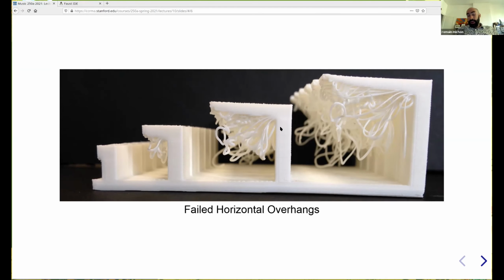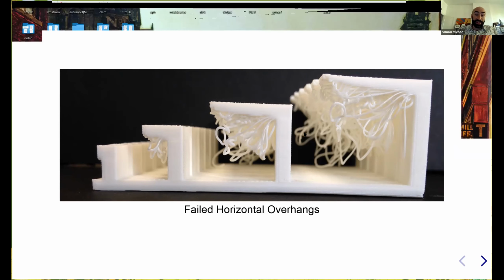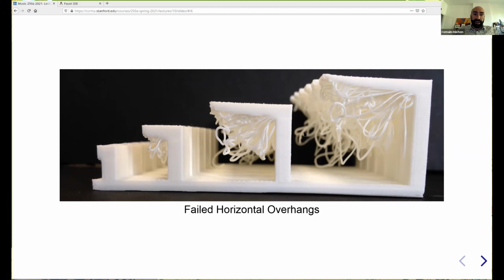You can also 3D print support material with the same material as the one that you're printing the object with. In some cases it works, but in many cases it's kind of annoying because you're going to have to break the support material, and its shape is optimized to be easily breakable, and it's the slicer which is going to take care of that for you. You don't have to worry about it. But usually it will leave traces, like there will always be artifacts on your object, which are the leftovers of the support material. And then it's more work because in some cases you might want to sand the object to get rid of these artifacts on the surface of the object.